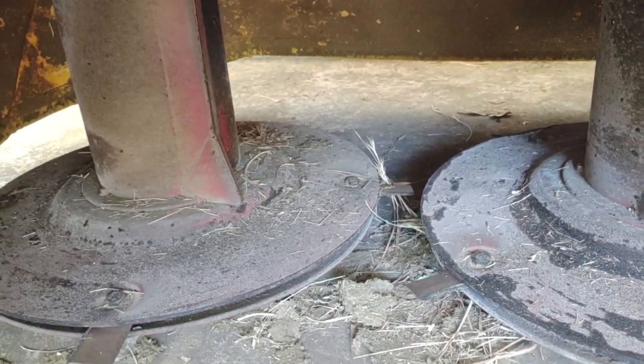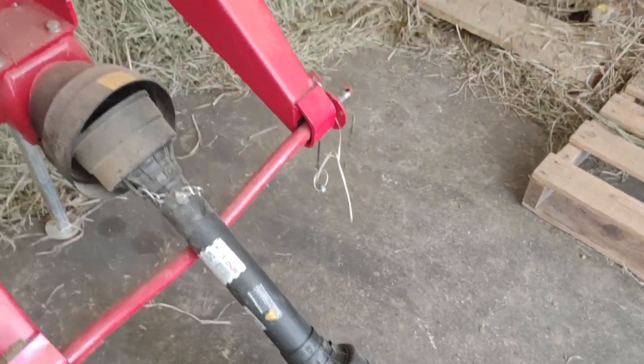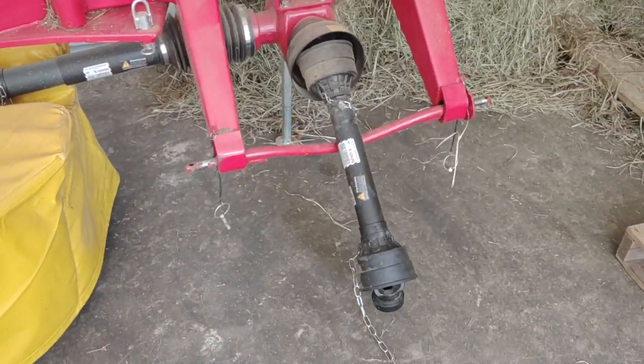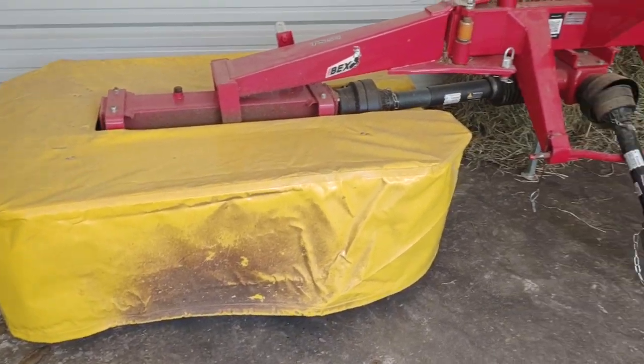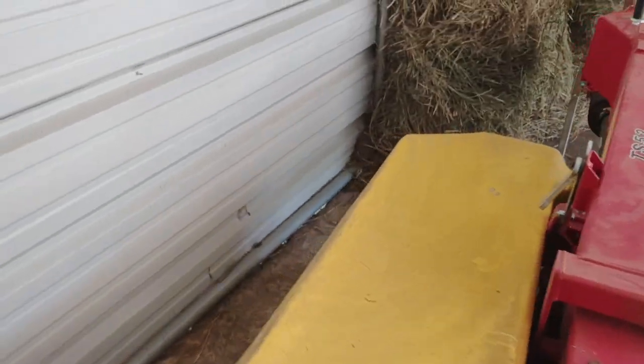I take a tape measure and measure the front cutter, and there's the back cutter — when it gets level, that's how I set it. I don't set it off the cage or the top; I set it off that. We actually have a riser plate — I highly recommend the riser plate. It'll leave about a two to two-and-a-half inch stubble. All the drive shafts come with it. It comes in a box and it took me and my wife a good full day to assemble. I'd buy the riser plates at the same time you buy the drum mower and put them on before you assemble it, because they are absolutely nuts to get on once it's assembled.